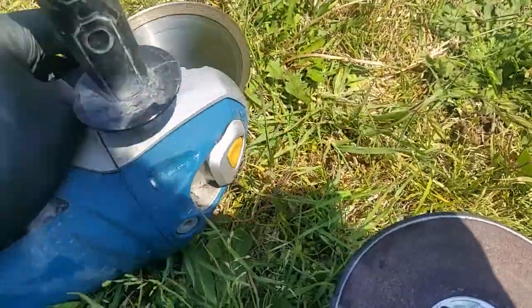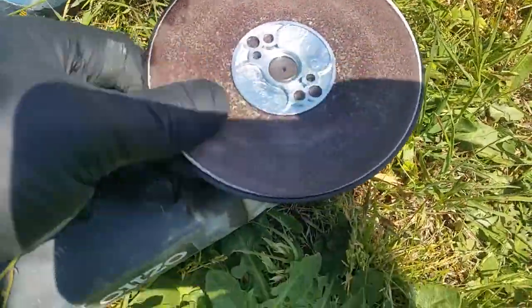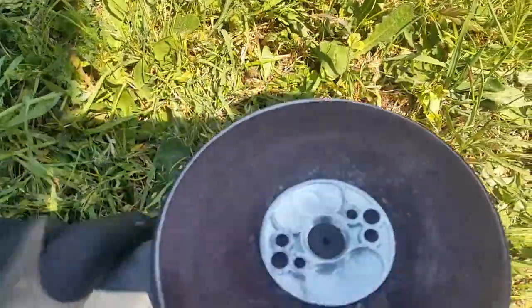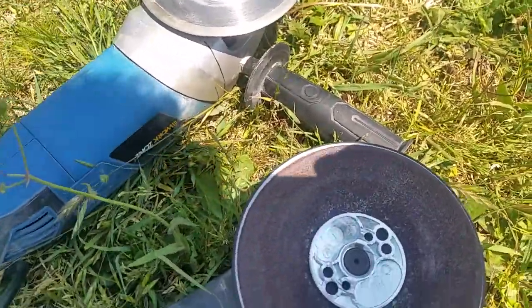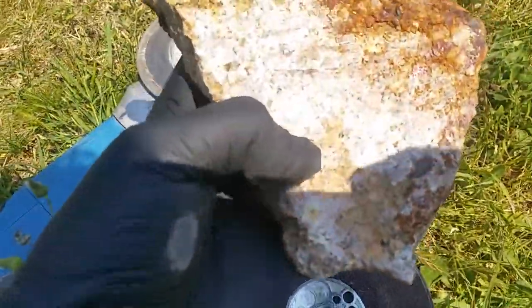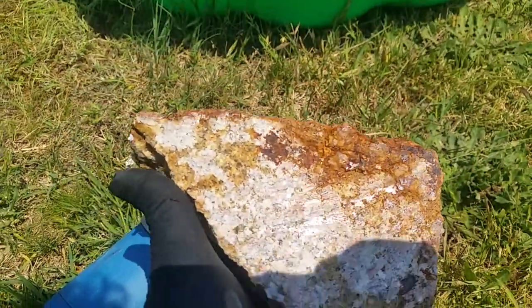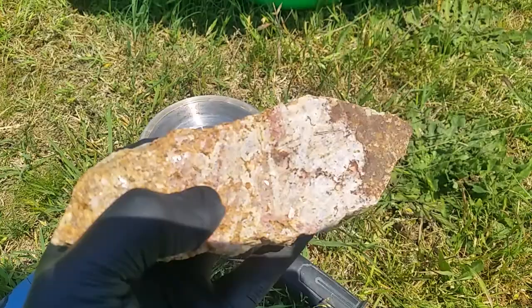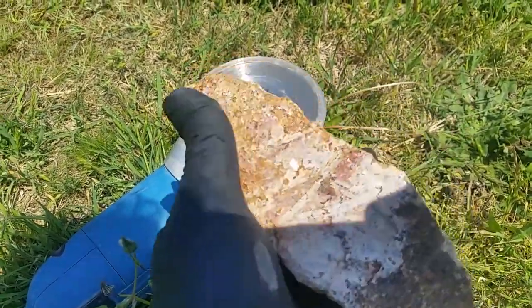Here is the diamond wheel that does the cutting, and this is a 600 grit carborundum that was used to smooth off and try to remove the tooling marks from the grinder. If we look at this face here, you can see the glints of shine that are the smoother high points — that's the 600 grit. There's more effort spent here, and we'll go over this with sodium silicate and you'll see how this will disappear.